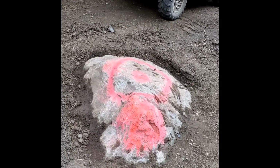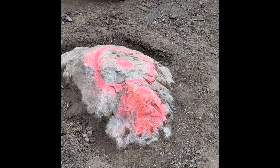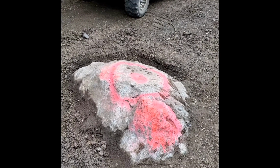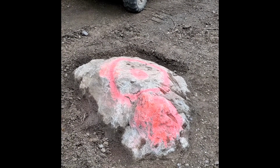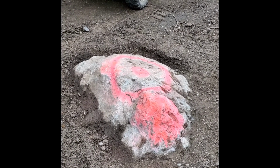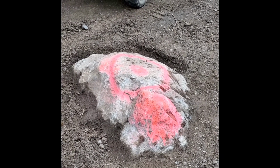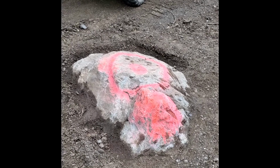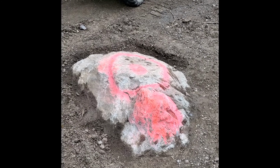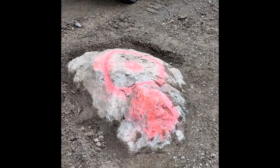It just came today. We're going to drill a series of holes in this rock, and you pour this slurry, this Dexpan, into them. It has an expansion rate of about 18,000 psi, and it expands. We're going to drill a series of 9 holes in this rock at different angles and pour the Dexpan in them. Within 24 hours, you come back and this thing ought to be easily picked out with the excavator and busted up. You could probably pick up the pieces by hand, but why do that when you have hydraulics? Anyway, this is the first step.